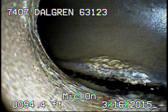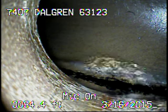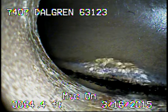Today's date is March 16th, televising a sewer line from the 4-inch roof vent. The sewer line had a bunch of tree roots in it, so I ran a 3-inch cutter through the line. Right now I've got the camera through the line and we're looking at the connection for MSD.